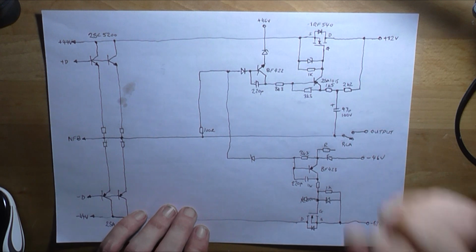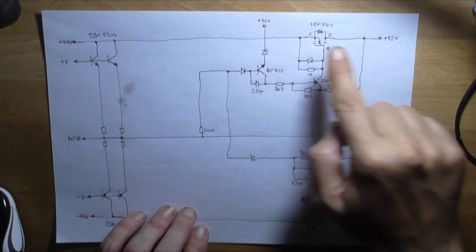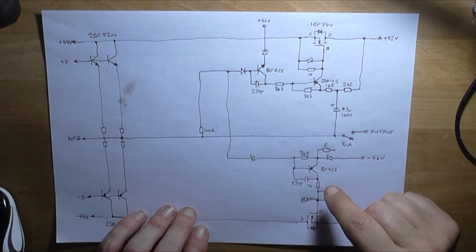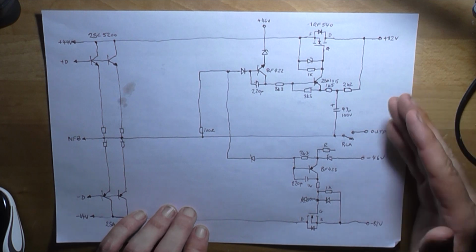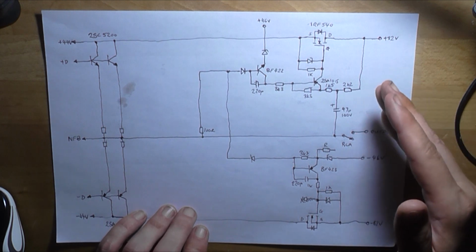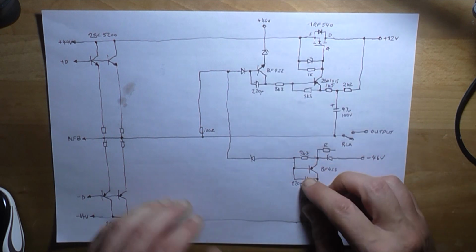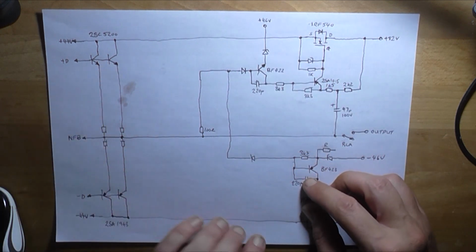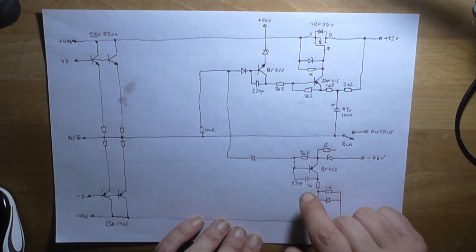Yet again with a quick one for you, and a last look at this T1 subwoofer amplifier. I've done some investigation and reverse engineered the MOSFET series pass regulator circuit, just to see how it functions and why we're only getting 88 volts on the supply rails to each of the output stage collectors. So we'll have a look at what I've got.